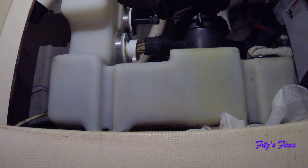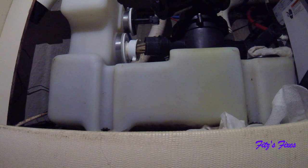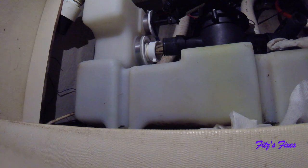There's our culprit - look at that. Somebody flushed a wet wipe! You can't flush anything but marine toilet paper in these things, it doesn't work. It doesn't smell like anything because there's laundry detergent all through there, but that's a wet wipe - or actually a sanitizing rag, the kind for wiping around toilets. Some idiot flushed it. Alright, let's get this apart and get this fixed.